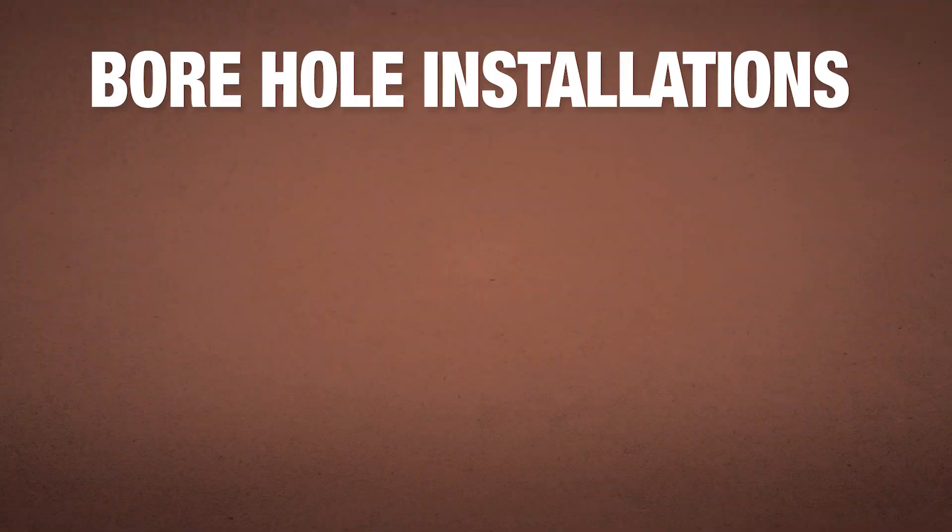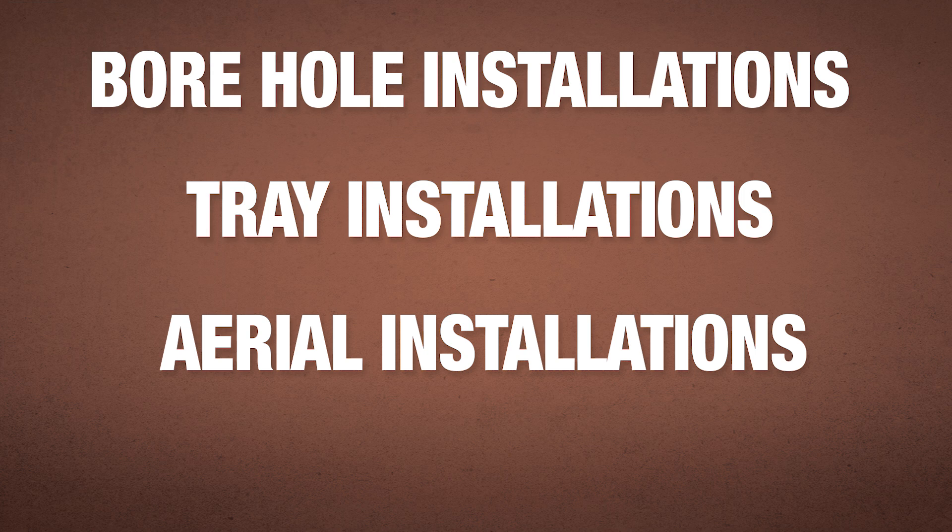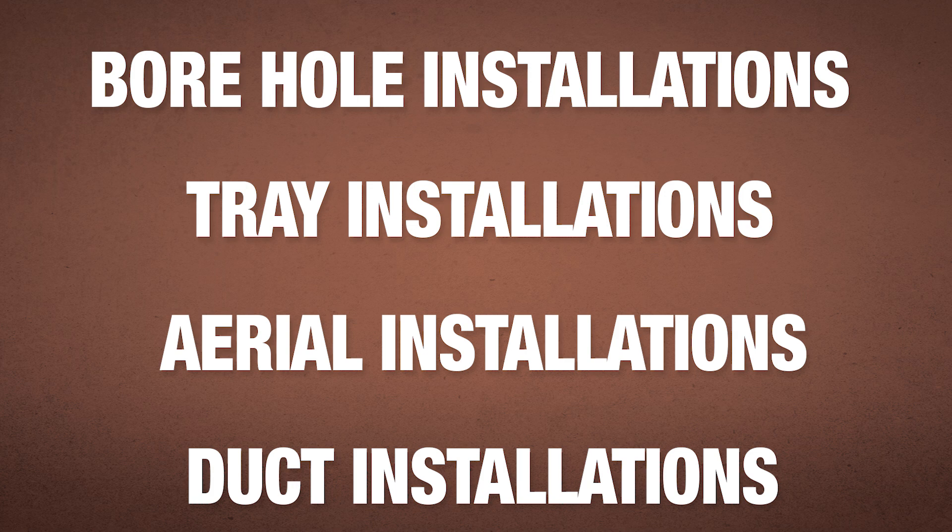Can it be used in other applications? Certainly. We sell this for borehole cables going three to four thousand feet underground, tray installations, aerial installations spinning the cable on a messenger, and pulling it through duct. Pulling cable through duct is not an easy process, but with AirGuard, because it's very round and concentric in construction, it's a better pull through old duct systems than a CCW cable with its corrugations. You can pretty much install this cable anywhere you would a CCW or MCHL cable.